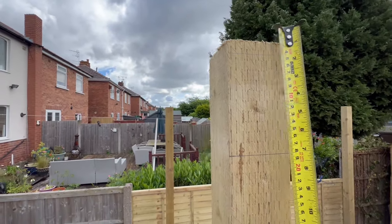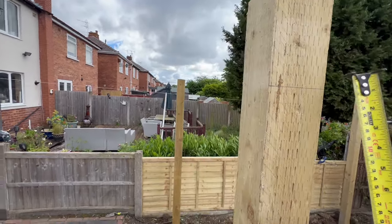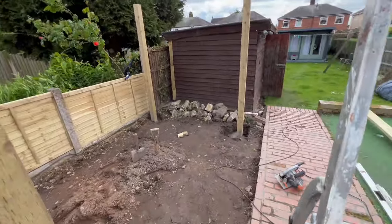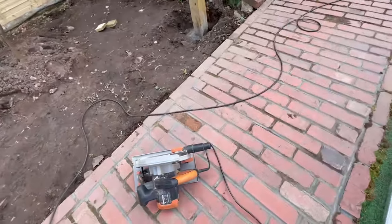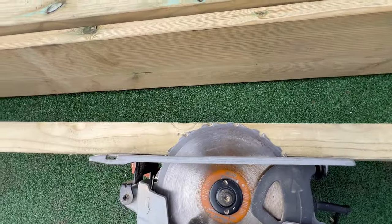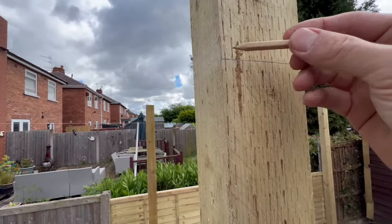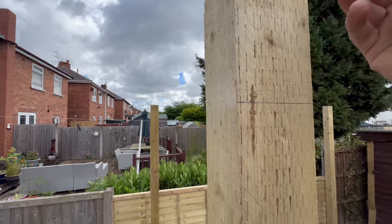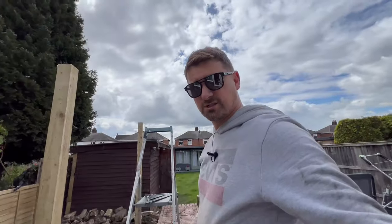The width of the timber I'm using is 170mm. I've got my tape, put a mark on there for 170. Then I'm going to set the depth of my circular saw to the depth of the wood. When I cut it, I'll just make loads of little cuts all the way across, and then I'll be able to get my chisel and chisel them out.